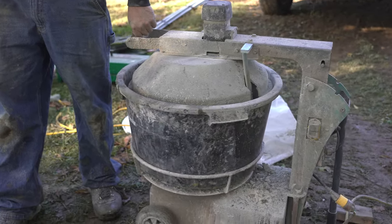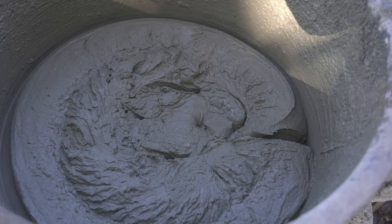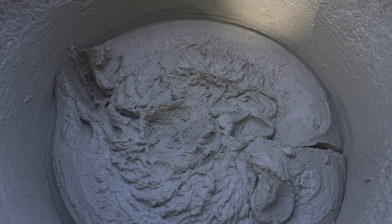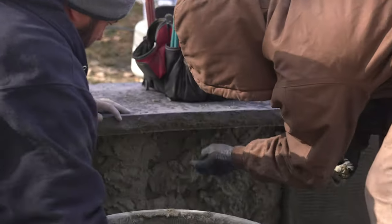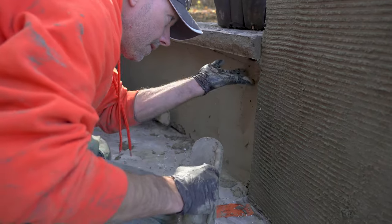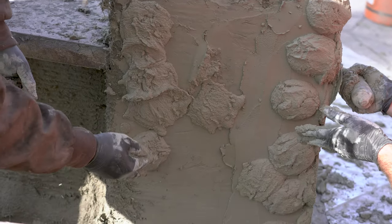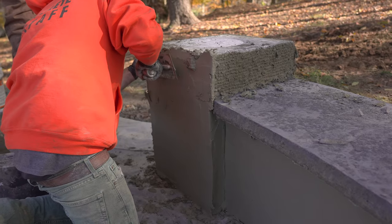After mixing, scrape the sides a little bit and then mix it again. Once you get this to the slump you're looking for, it's important to let it set for about three minutes, because it's going to tighten up a little bit again. Let it set for three minutes, remix it, and you can give it a tiny bit more water if needed. If it looks good after the remix, go straight to the wall with it. You want to get this stuff up on the wall within about 20 minutes of mixing. When throwing this stuff up on the wall, I like to break it down into two steps — first, a really thin coat that we drive in with a trowel into all the fingers from the scratch coat, and then we follow that up by throwing handfuls of the mix right on the wall. On this drive coat, we don't want to get too far ahead of ourselves.